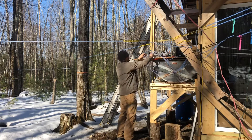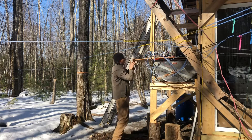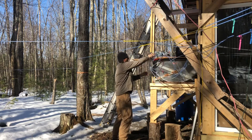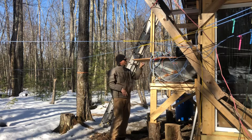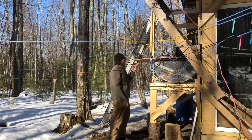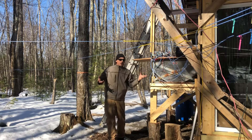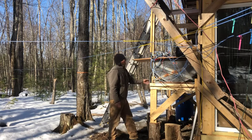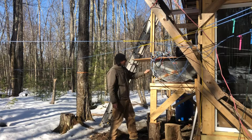It's running in this direction and expels the sap that it's pulling. One of the keys to this whole setup I've learned is to have an additional line that runs back to your tank. What that provides is more sap, more liquid for the pump. The pump runs much better when it always has liquid running through it. It's designed so it can run dry, but it's best it's not run dry — and most importantly it runs stronger with the fluid running through it.